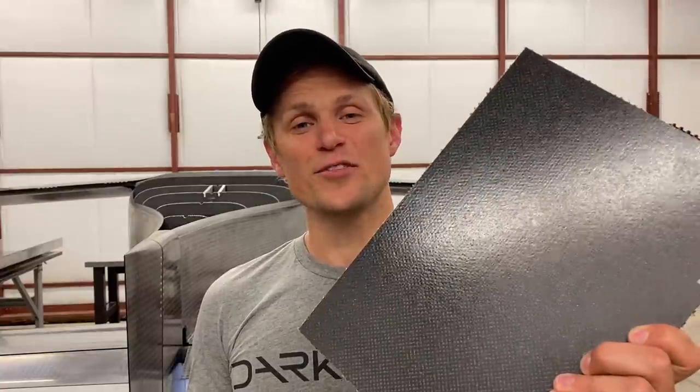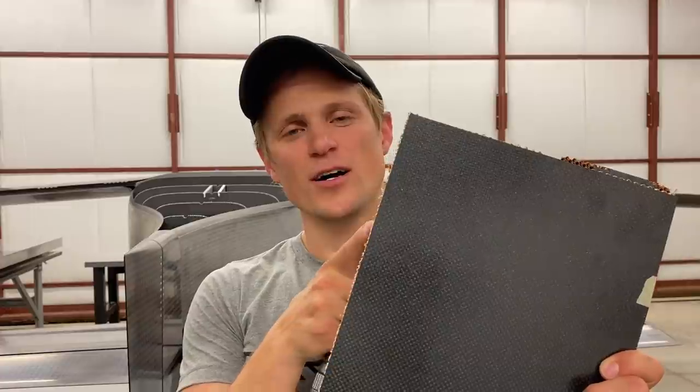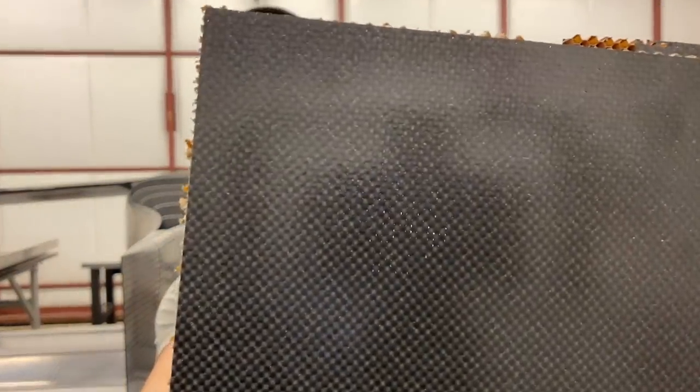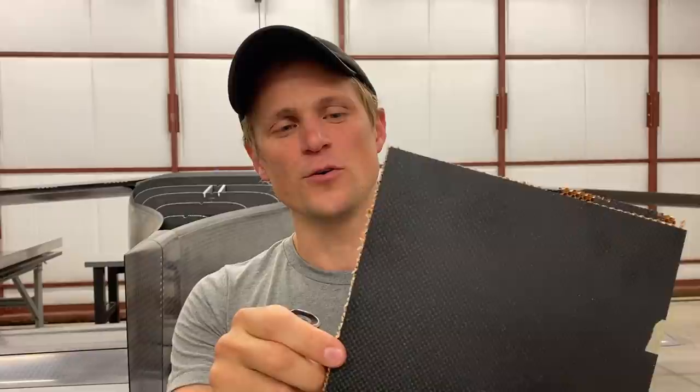This is sample number three that we got from a panel manufacturer. This one's made from a prepreg carbon fiber skin and a quarter-inch aramid core. Very light construction on this one, which we liked, but one issue we found is that the way the skins are made they're full of holes. This would have been unsuitable — if we put this in the fuel tank, the honeycomb cells would have just filled up with fuel and that would have become dead weight — so we didn't end up using this panel.